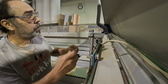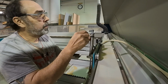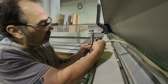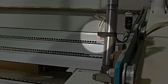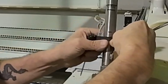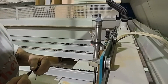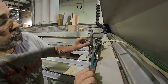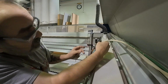And we are going to crack this sensor loose. Make sure everything is nice and loose on it so we don't fight it. Slide it down, and find the on spot. Make a note where the high spot is. When we move it down, we find the low spot. There's the low spot, and that magnet inside depends on what size air cylinder it is. This one appears to be about a 10 millimeter wide magnet. So we just move that up there so we hit that somewhere in the middle.